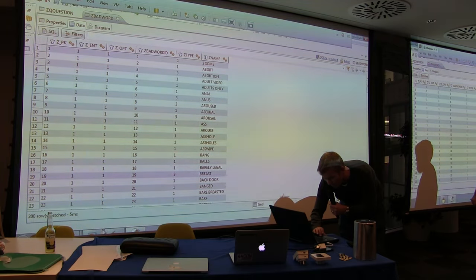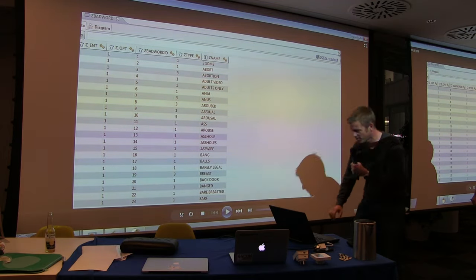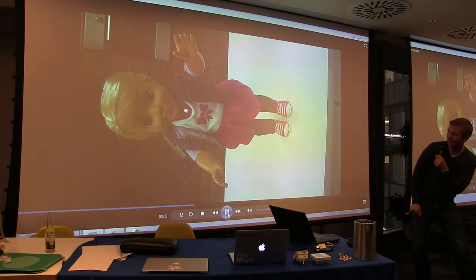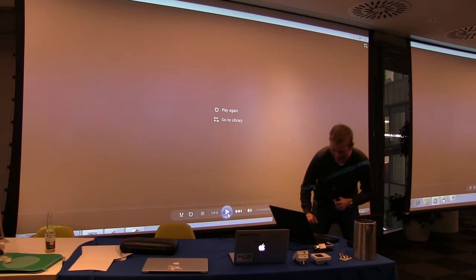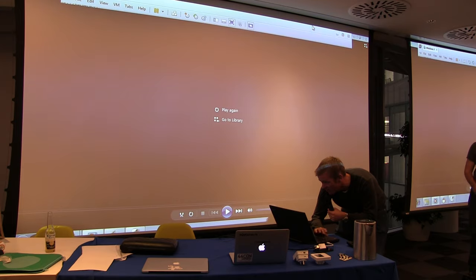We pre-recorded a demo. The doll says: 'Calm down or I will kick the shit out of you.' There are lots of things you can do with that. You can also add swear words, and you can mess around with the API. She does a lookup on the Wikipedia API if there's a question she doesn't know locally — and she does that unencrypted. So you can just man-in-the-middle it and send whatever content you want back to her.